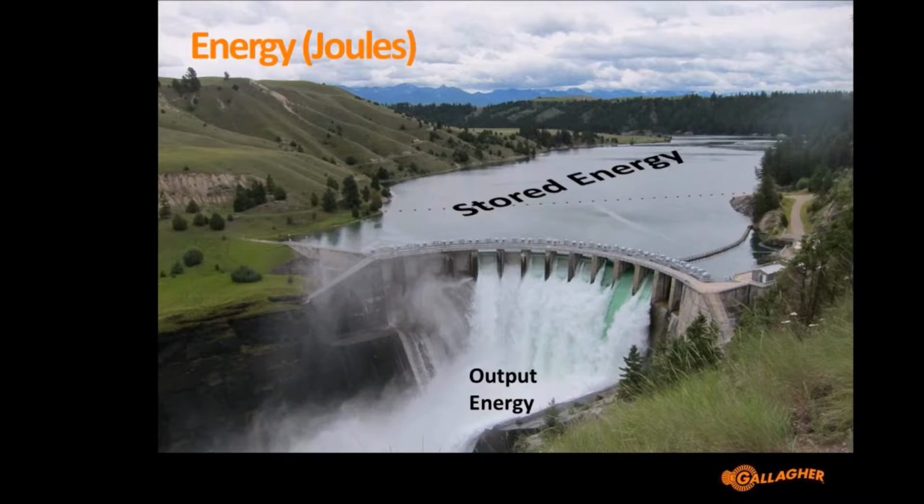How does that relate to water? I think of it as if you've got a big Energizer but only a small fence, then the Energizer's able to store all that energy, but it's only putting a little bit out into the fence and the rest of it is lost. It's the equivalent of your dam overflowing and the water getting lost. It's not going through the channel of the lead out, which is why it's important to match your system together.